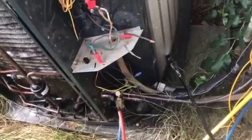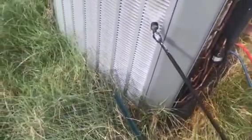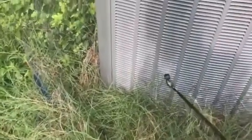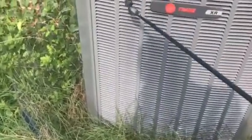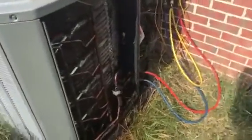Everybody says the spine fins are so tough to clean. I'll just face this thing upward. Keep in mind I'm using a mild cleaner that won't destroy the finish here. It probably won't clean 100% as well as coil cleaner, but my back-flushing that I do with the hose from the inside should take care of it. We'll shine the camera and get some footage up inside of it after we're done, just to see exactly how clean I get it without taking it apart.